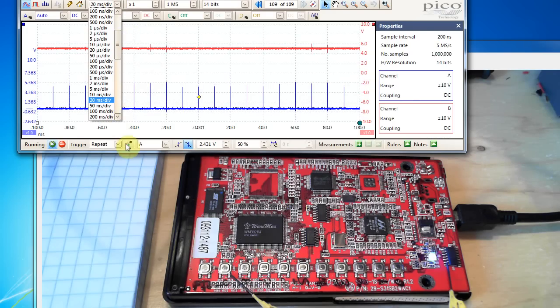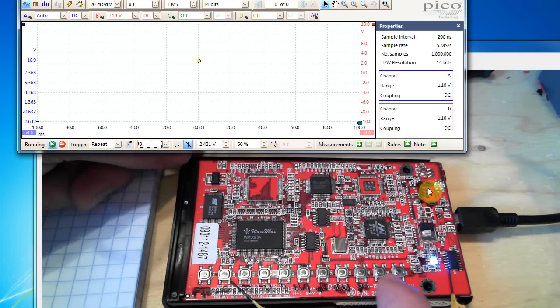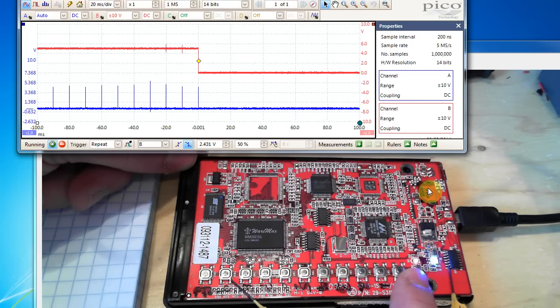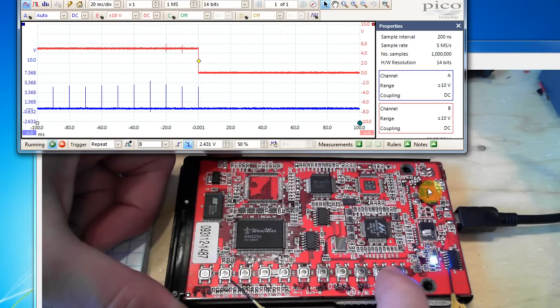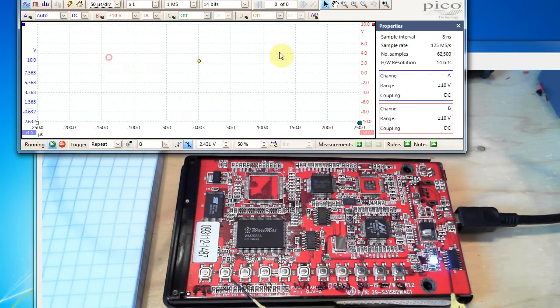To trigger the capture I'm taking advantage of something I figured out: the LED obviously goes on when you enter the wrong password. If I enter zero zero zero zero it goes on after every button press. But there's a convenient signal point that only goes low once all numbers have been entered — it's not low during the blinks. You can see on the scope nothing is changing; it triggers on the falling edge. It's kind of lucky that it works out being so convenient for us. If you didn't have that signal, you'd have to filter out all the extra blinks.